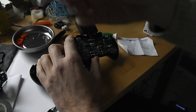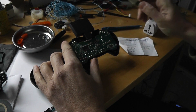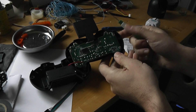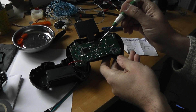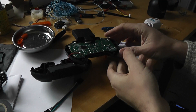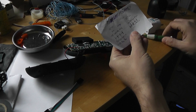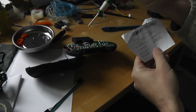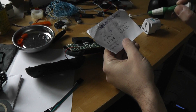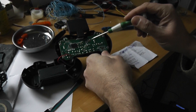This is a nice hexacopter. It has an XN297 RF chip, and it has approximately eight pads. For sure one of them is the ground. The first thing is to localize where it is. Thanks to photos I made on the other side, I have some hypothesis about each pad. The ground should be this one.